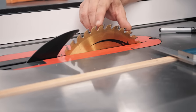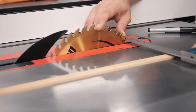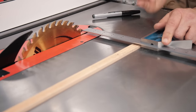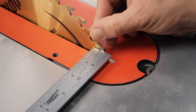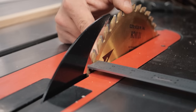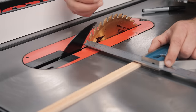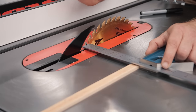I take the marked saw tooth, put it at the front part of the cut, take my combo square, and rest it against the tooth. I have a piece of wood in the miter slot — any play doesn't matter as long as it's the same thickness. When I press up against the tooth it's pushed against the miter slot, I lock my square in, and I know it's exactly even with that tooth. When I rotate backwards you can almost feel it just barely come in contact with the square. Then I take that tooth to the back of the cut, put the square there, and feel whether the contact is the same. If you're getting more contact — a rougher sound, it pushes the square away — that's okay. It's when it doesn't touch at the back that you're in trouble, because that means the blade is pinched inward.